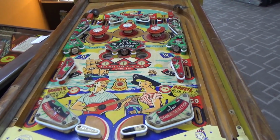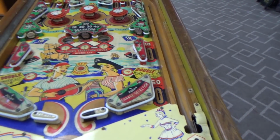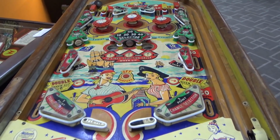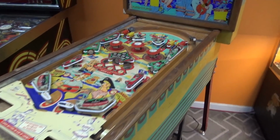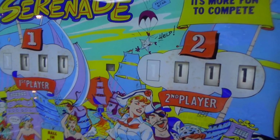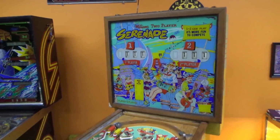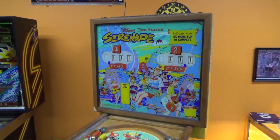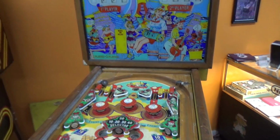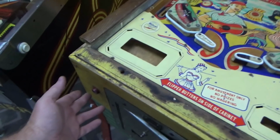Okay, so I'm going to set it back down. It's up on the cart. I'm going to set it back down, and then we're going to see if it's any better than it was at the end of our previous video. All right, folks, so we're going to try it. Now, whenever I clean the score reels, I always leave them on 1 or 2 or something like that so that they all have to reset whenever the next time you power it up. Just so that you know that they're all resetting. Good time to check it, right? I also have the ball count unit not on 0. So let's see if we get anything any different.